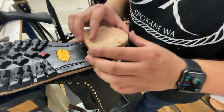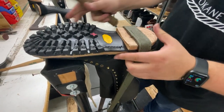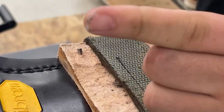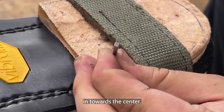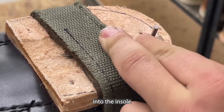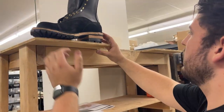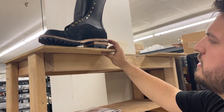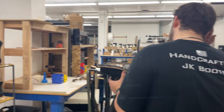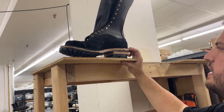I've got my cap now — one thing I need to do is check to make sure it's not rocking. See how there's a little bit of rock right there? I just need to grind down the front part just ever so slightly. The precision is just amazing. There we go — that's how it should be right there. The whole thing is going to lift up okay. Nice, good even coat of glue — same thing, nice and even all the way around. Why is it hollow like that? So the idea is that when pressure comes down it comes forward, and that will also stick to the center — that's where your heel is, dead weight.